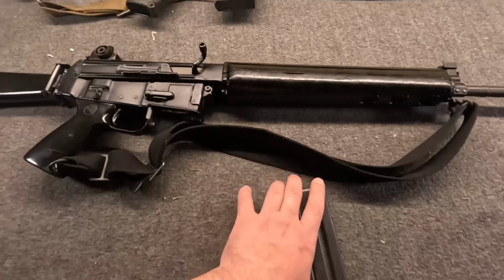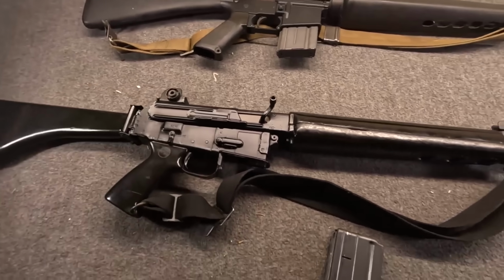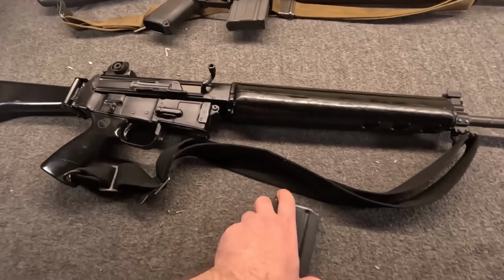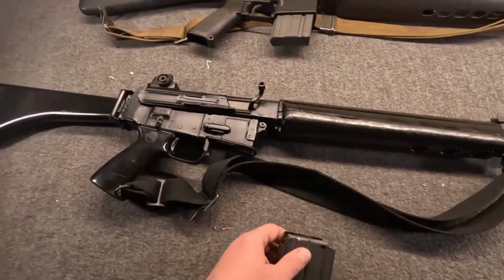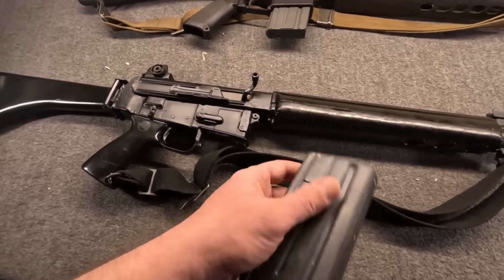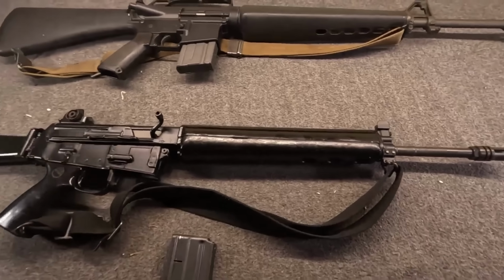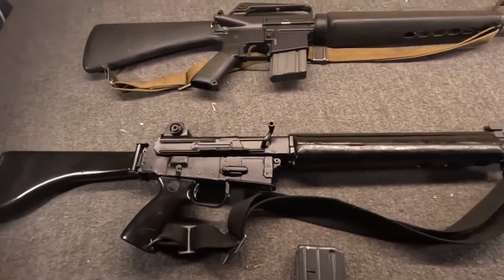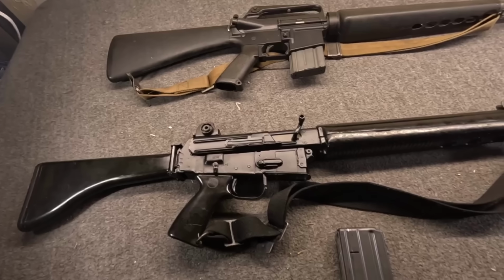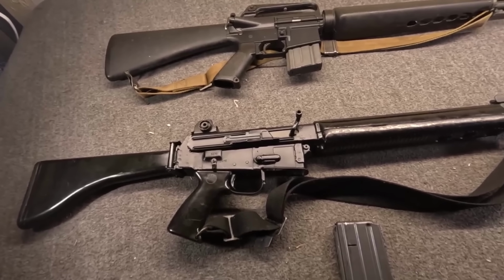And the magazine. They found that this gun had a very high rate of fire. I'm wondering if they were using IMR powder or ball powder ammo. By the way, they found that it had a high rate of fire, so much so that the bolt would overrun the magazine and feeding would jam up, and just a few other things besides. Plus, of course, by 1964, they had already purchased their first major order of AR-15s from Colt, and that was the direction they were going.